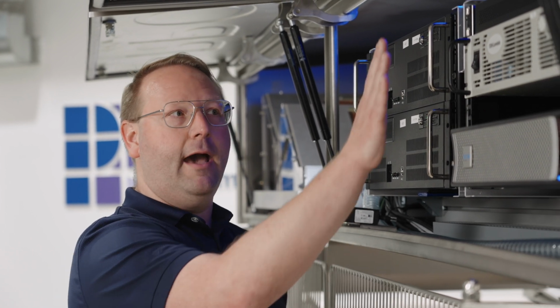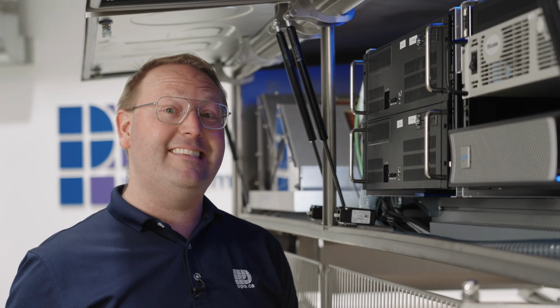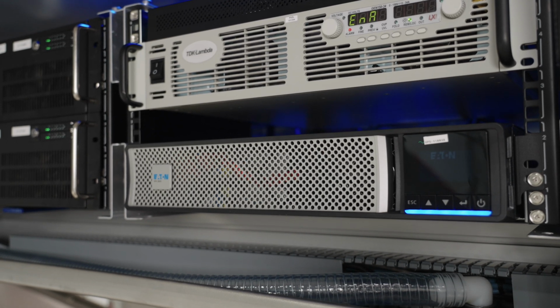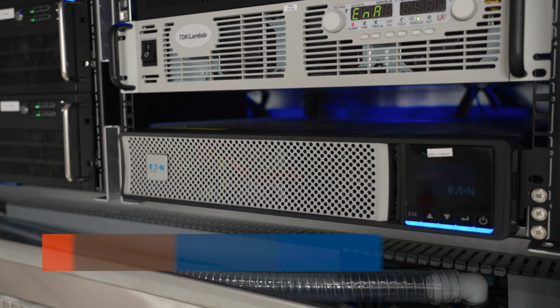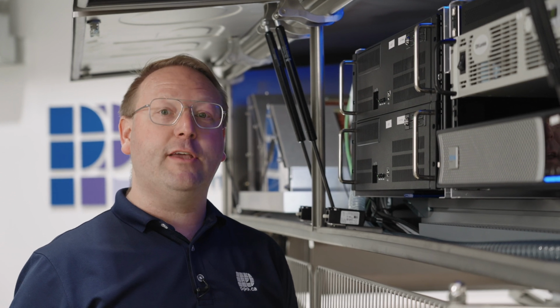Another couple of components we have. One is the power supply for our hyperspectral lamps. This power supply is 120 volts DC, so that we can maintain a strong and constant signal for our hyperspectral imaging system. The next component is a UPS. In case there are momentary lapses of power inside the plant, the whole machine doesn't go down. This keeps your PLC, HMI, and the computers up and operational, minimizing the amount of time it takes to get back into operation when the power is restored.